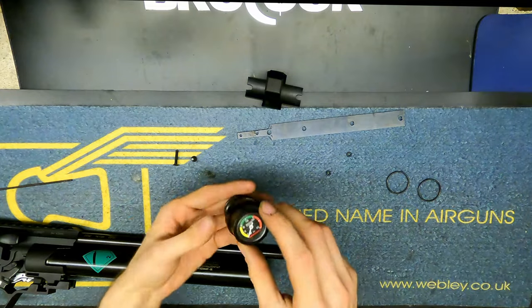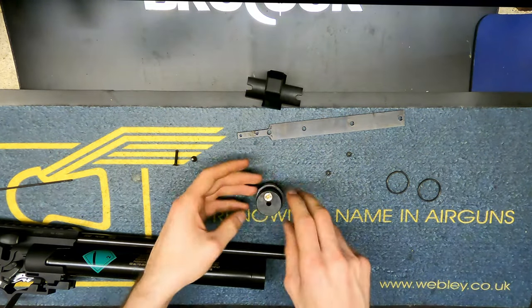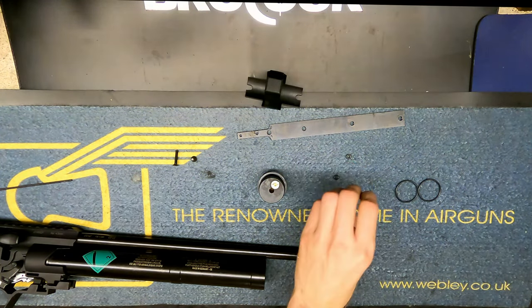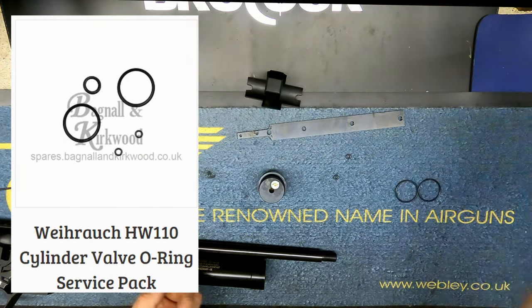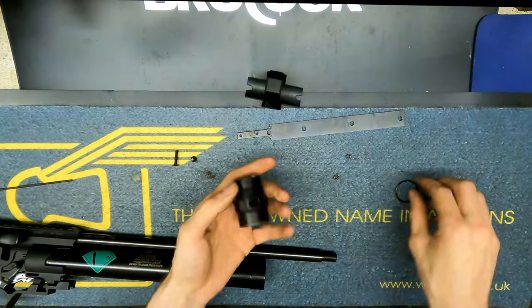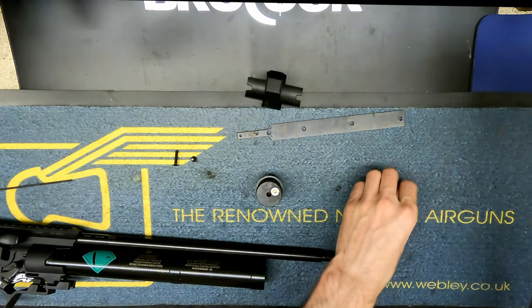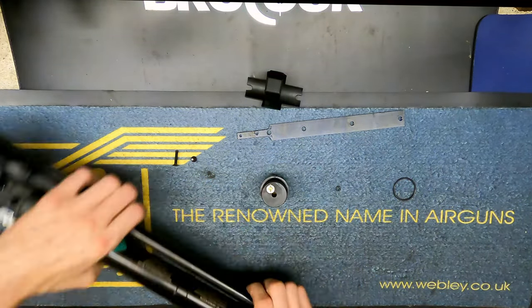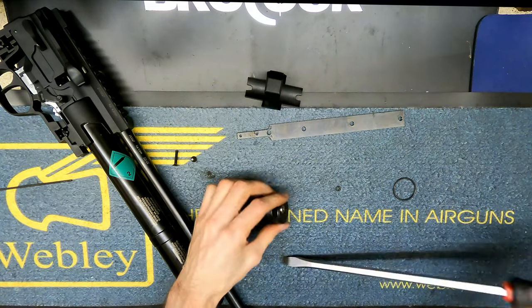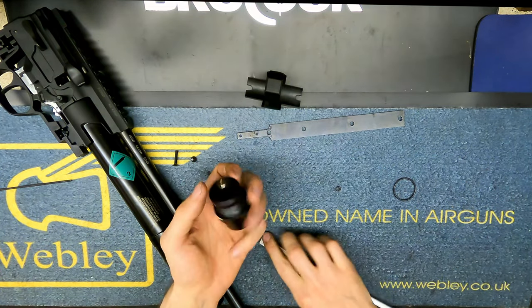If you are leaking out of that breather hole on the gauge, you're going to have to take the gauge out - we're not going to do it on this video, but I'll put a link below to the HW100 video that shows changing that o-ring. The middle size o-ring in the kit is the one for that. What we're going to do here is just replace the o-rings causing the issues - the one that's in there, and you get two of those in the kit so you'll only need one. We're also going to replace the one on the outer. To remove the inner one, I use a big broad screwdriver - from factory these are tight in, so make sure you've got something broad. I see loads of these where they've been chipped because people have used the wrong size screwdriver.